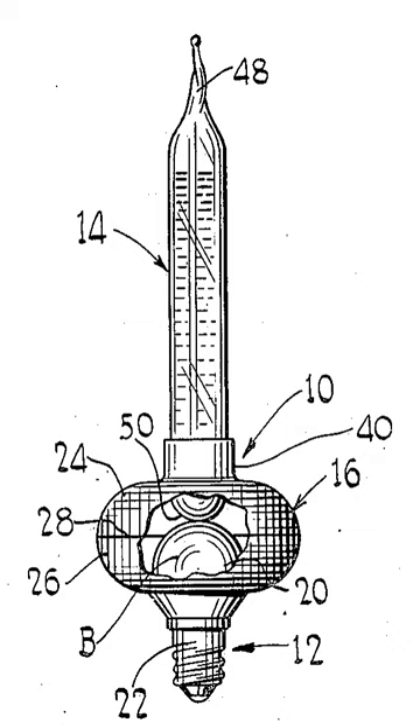However, they were often packaged with a nine-socket string to extend the life of the bulbs. Bubble lights could also be purchased individually for use in existing light strings. Modern incarnations either use candelabra base 120V bulbs, or push-in wedge base midget-size miniature bulbs, most commonly 10–12V bulbs wired in series.